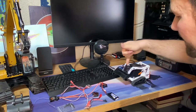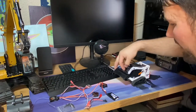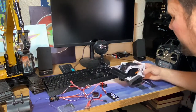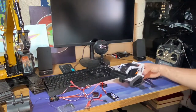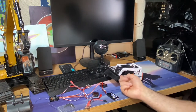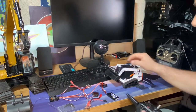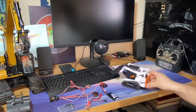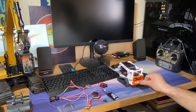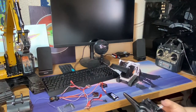Huge difference. Maybe you could do that cleaner with a little black brace, maybe lower down behind the servo with a smaller 9kg servo. That's what I would do if I could do it over again. Obviously on the next one I'm going to do it a lot cleaner. I may even try to put the servo underneath here on this back side and link it somehow from underneath — I think that would be much more interesting. More hidden, look better. Laying the servo flat and then building a cover over it so you can't even see it in the back. It's all about just learning from it and doing whatever you can to make it better.